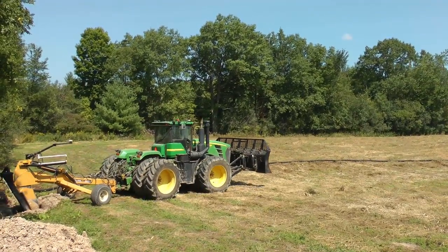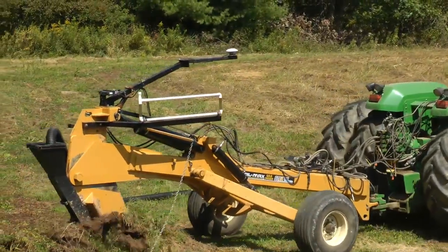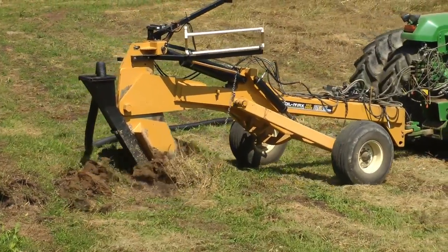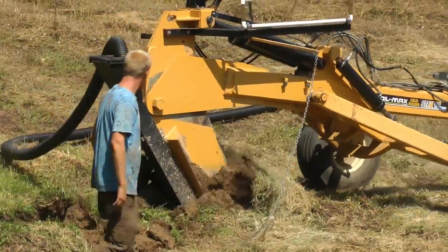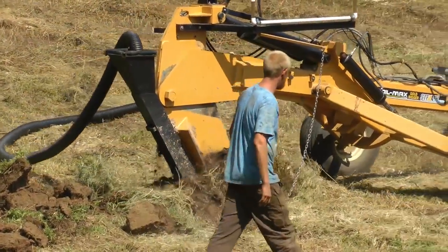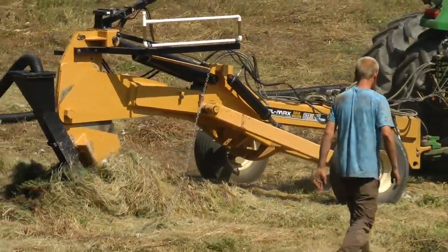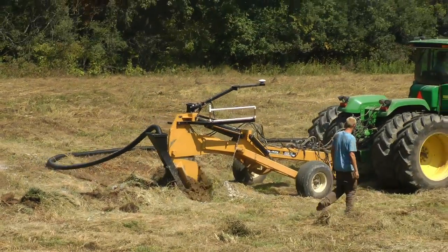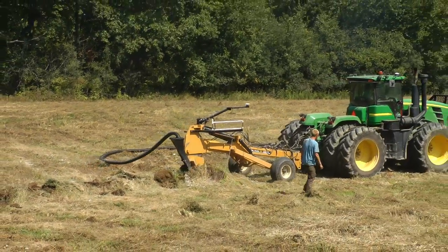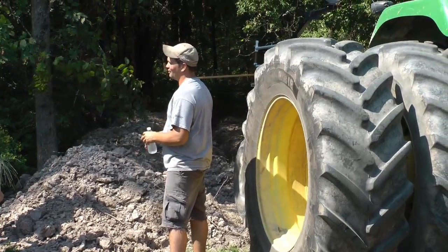You do have to be careful about ground speed. This tractor is roughly 350 horse and will pull pretty well, but you don't want to go pulling your plow at five miles an hour. You might never see it digging in the trench the old school way, but you can stretch this tile pretty significantly if you're not careful. The key is getting off smoothly and keeping your ground speed down.